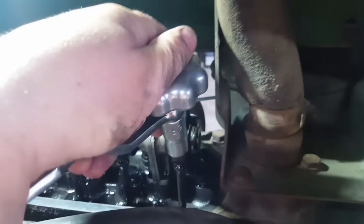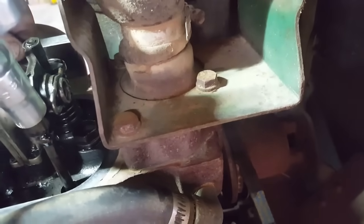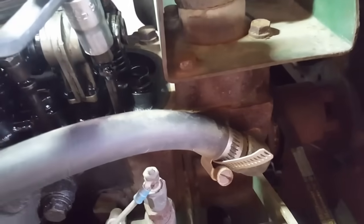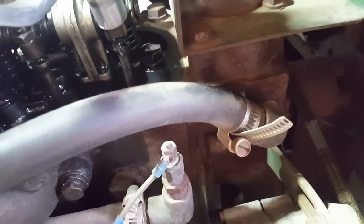I will make this whole thing turn when I tighten it down, and that came out pretty good. Just a skosh tight, but you know, they've got a 3 thousandths range between 19 and 21, so at 20 being just a skosh tight, probably about the equivalent of 21. Good enough. I like that.